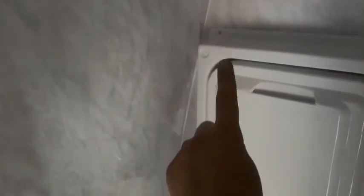Basically what you do is run your bead of silicone straight down there, and then get a spray bottle with just soapy water and spray it over the entire area, and then go down it with your finger or your rag or whatever you're going to use. It doesn't splurge out and stick, because anything that splurges out won't stick because the area is covered in soapy water. So when you go down, it only leaves in the exact place you want it, and you just get a nice clean bead of silicone or whatever sealant you're going to use down there. It just neatens it up.